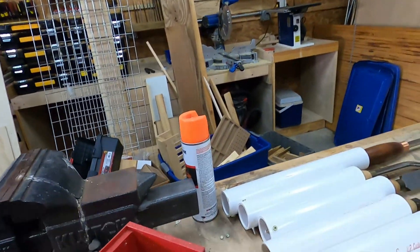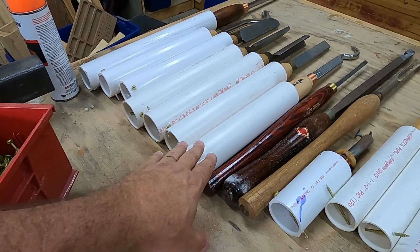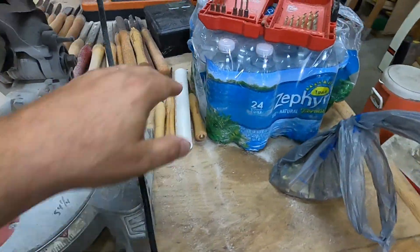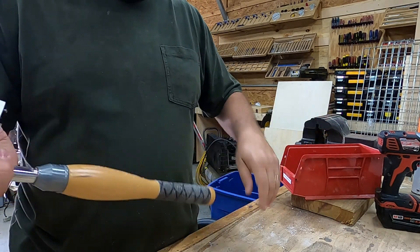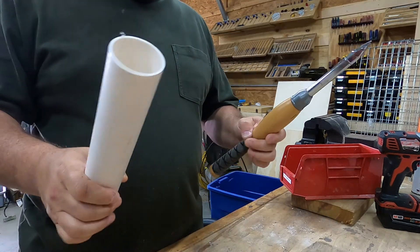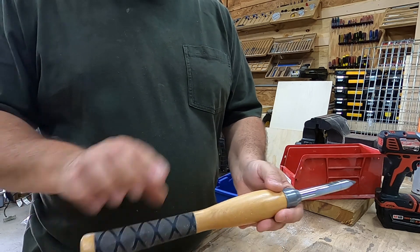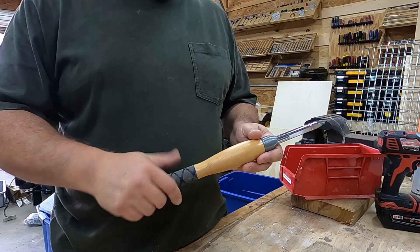Here's what I've done so far. These are the two-inch chisels that fit into a two-inch piece of PVC. This is an inch-and-a-half PVC, this is inch-and-a-quarter PVC, and then we've got three little ones which are going to be three-quarter-inch PVC. I basically took a measurement from the butt of the chisel all the way up to the broad piece on the neck, and I took all of the chisels for that particular size and averaged them.